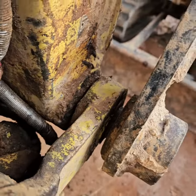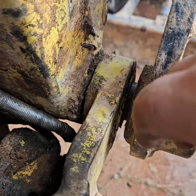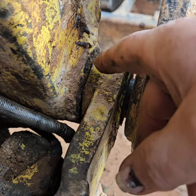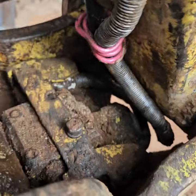I ordered some shims. I'm gonna put some shims in here — you're supposed to put them on this side, but that's for the thumb, I believe. The shims are one and a half inch inner diameter, three and a quarter outer diameter, and depending on the thickness of the gap you need to order them for that.